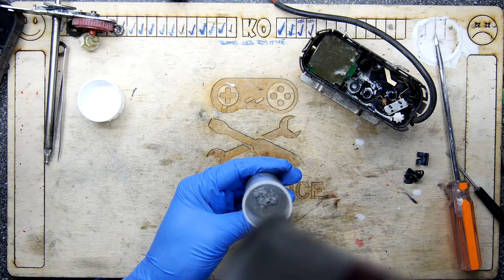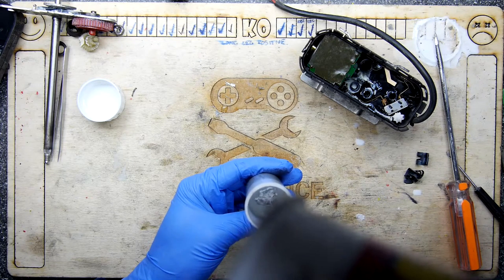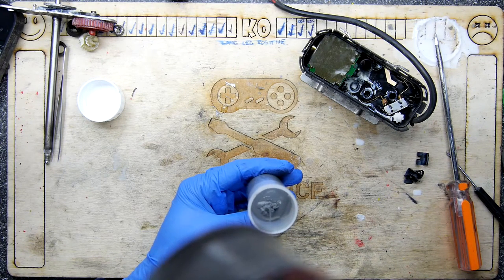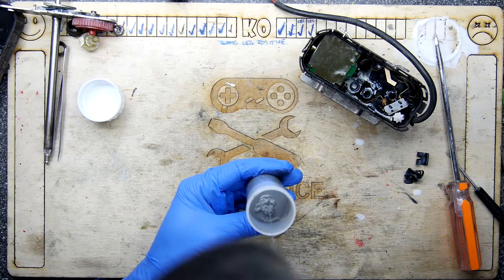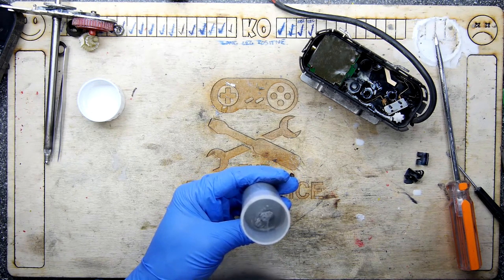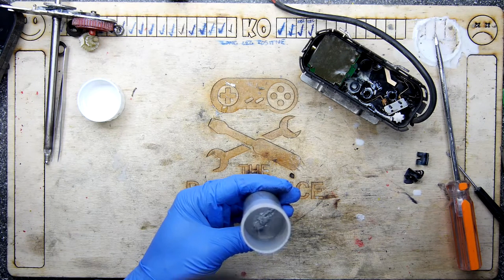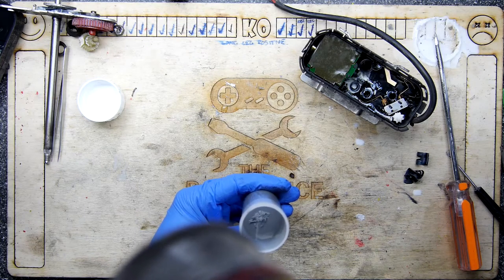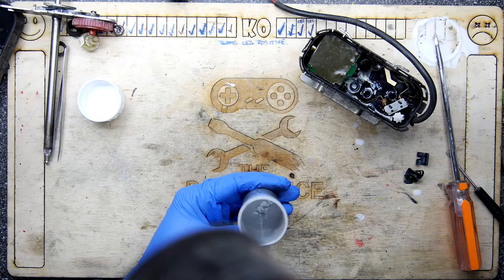We've got plenty. When this is all set, we're going to have a bit of a filling spout where the screw and the magnet is, so the magnet and screw will form our little funnel for filling. When we take it out of the mold we'll be filling from the thin end up to the fat end — upside down basically. Look at that tube — I thought I was going to run out but I end up with way more than necessary. That's how it always works out. I've got plenty of these tubes so even if I cut one up I've got more to slide the mold back into — the tube will keep all the sides together.